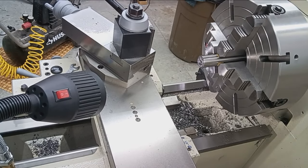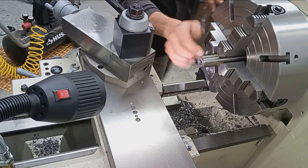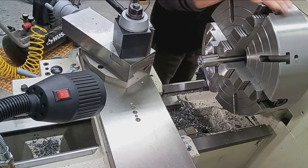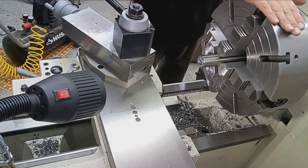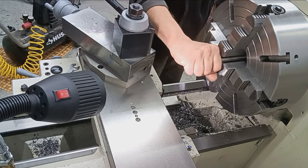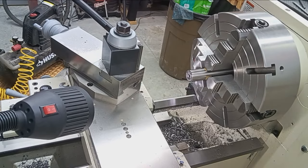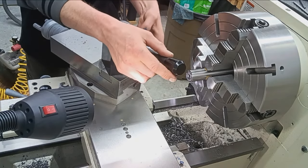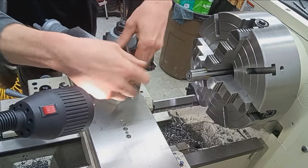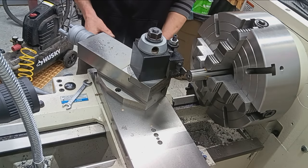Deviant Tactical Barrel Work. Okay, so as always, we've got the barrel installed in the lathe, four jaw chuck at the breech end, four jaw spider in the back end. Cool, so let's get our parting tool. Remove handle. And we're just going to take the thin little sliver off of this.